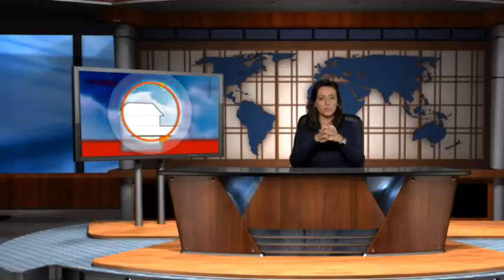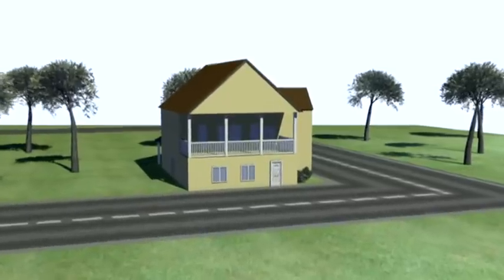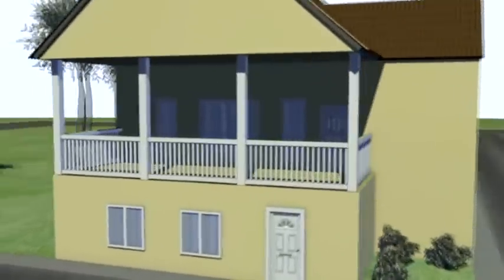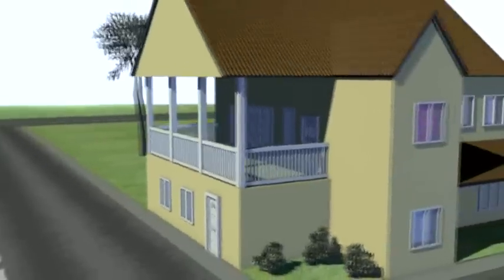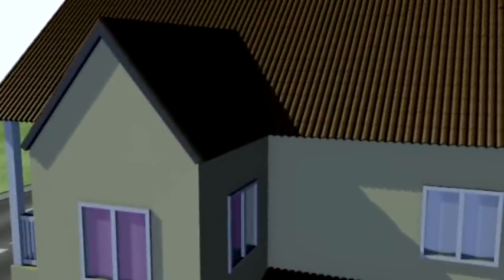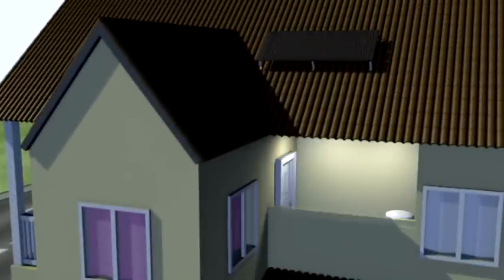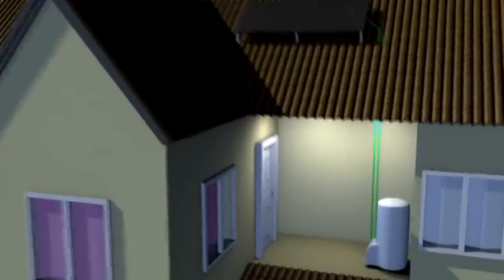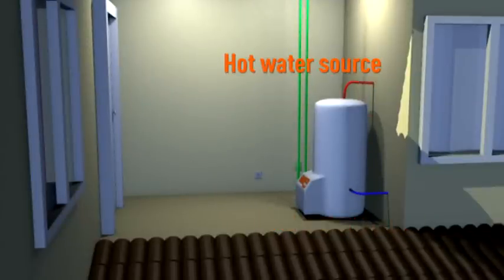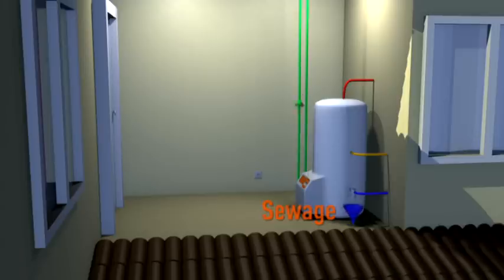Let's take a look at the preparations for installing an EcoThermo. The first step is to analyze the best location for placing the panel and the water heater, with the priorities being the best orientation and tilt of the panel, the minimum distance between the panel and the water heater, and the side where the water heater is to be installed. There should be electrical power, a cold water source, a hot water outlet, a drain point, and a sewage connection.